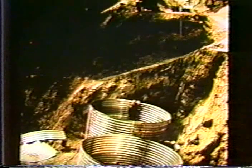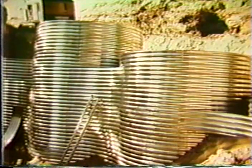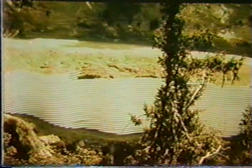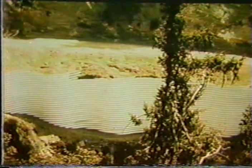Other systems that have been around, Kaiser Aluminum for a few years promoted this system, was using basically pipe. Large diameter pipe stood on end, typically battered, 1 in 6. And then these pipes would be backfilled with material, and then the wall would be built. And this is what this wall system looked like when it was completed. In this case, of course, it's being painted. And our direct federal office and Federal Highway Administration built a number of these walls. This is dating back a few years.